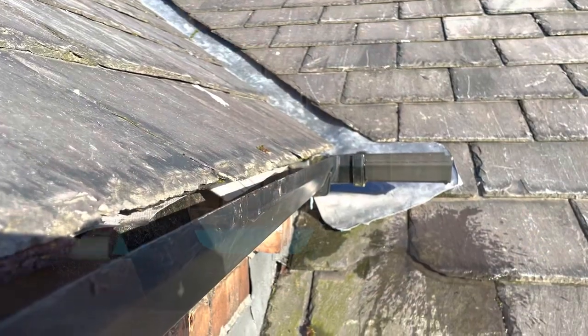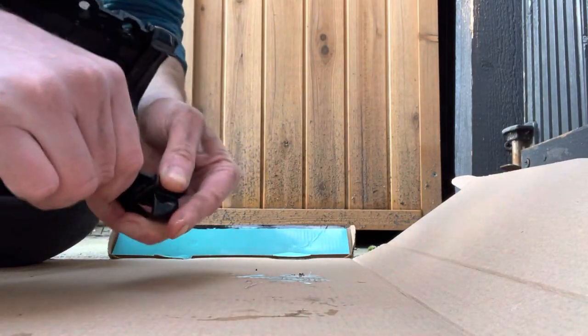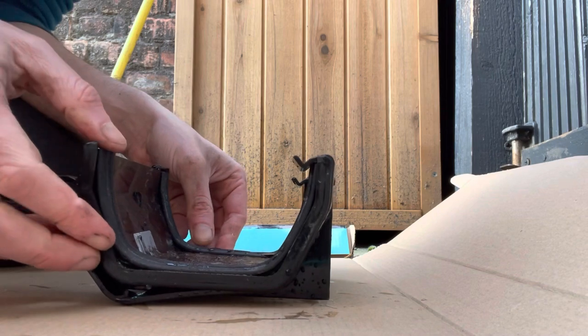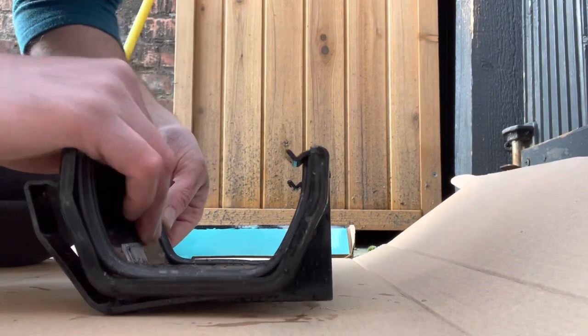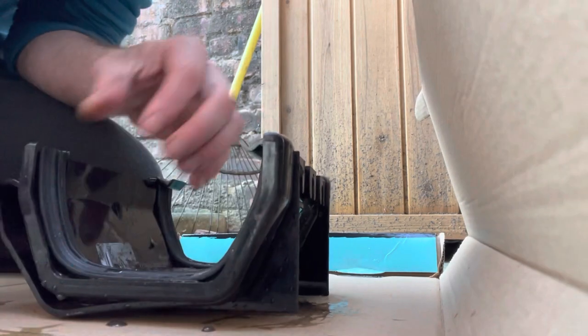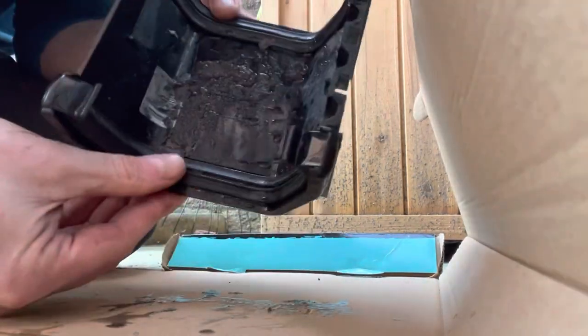That's fixed now - the wind was too much to film up there, so we'll show you a quick review of what we did. We just took the front clips off - one and two. Then we made sure the rubbers were aligned and all we did was place the old section on, then clicked that over. We put the screw in on the angle - you can see there's a hole for a screw. We got the next section of gutter, placed that in, then clicked that second one up. Make sure the rubbers are aligned completely and that's pretty much it.